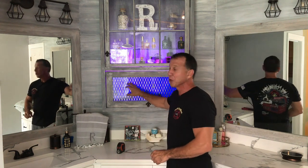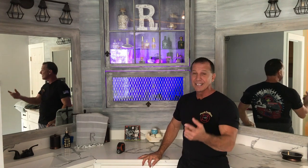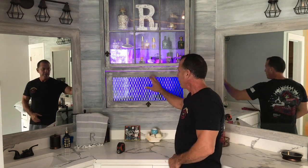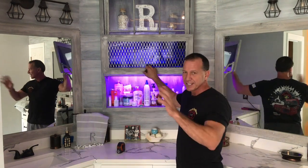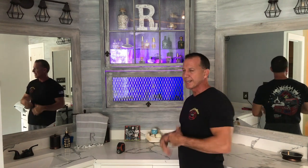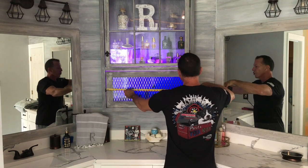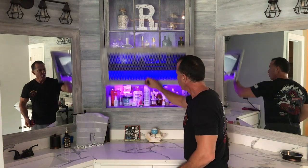Today we're going to cover making the door for this cabinet. My last video showed how to do the cabinet itself, and this door is actually easier than the cabinet. This door is simple to make and I'm going to show you how to add hardware on the next video — that's simple too. My opening right here is 31 and a quarter from there to there, and this is 14 and a quarter from this to this — the total opening.